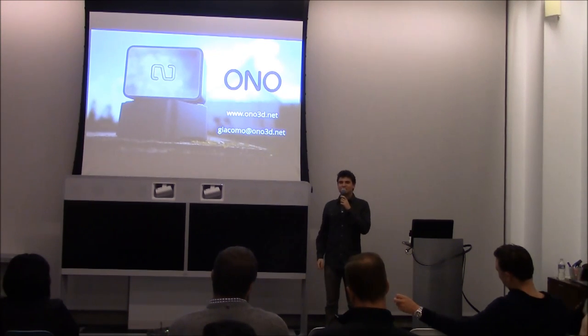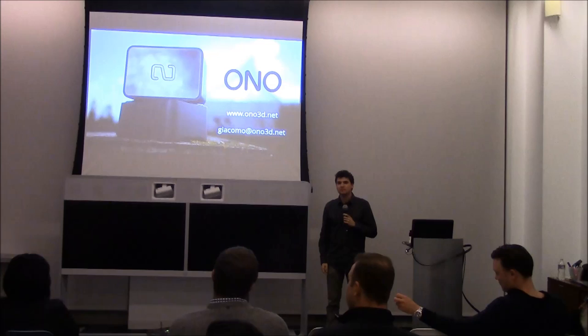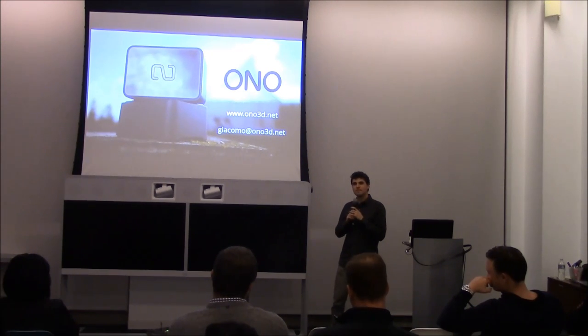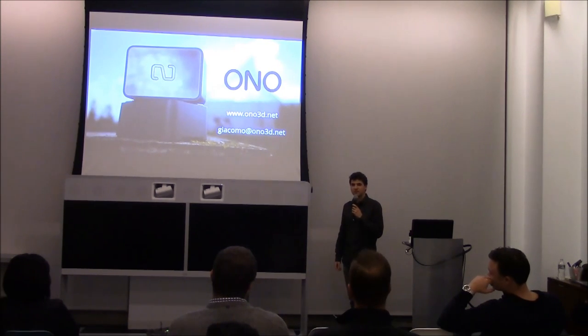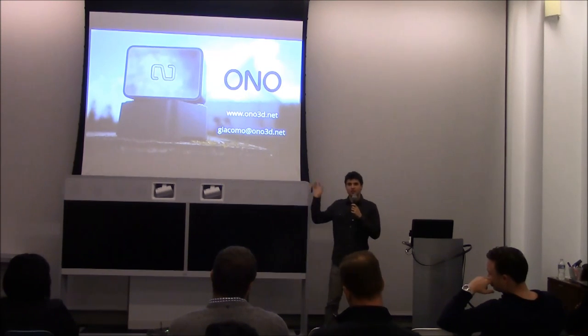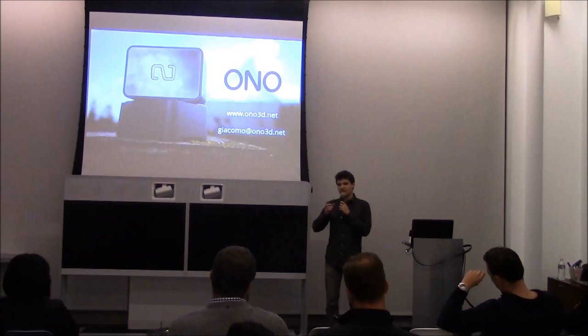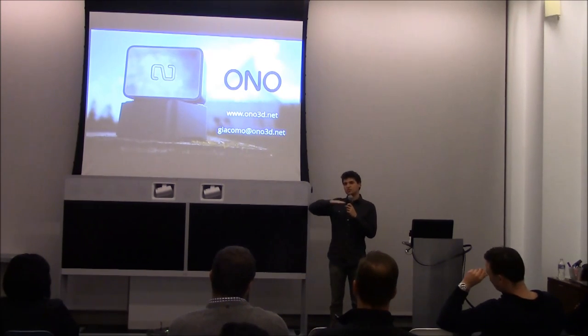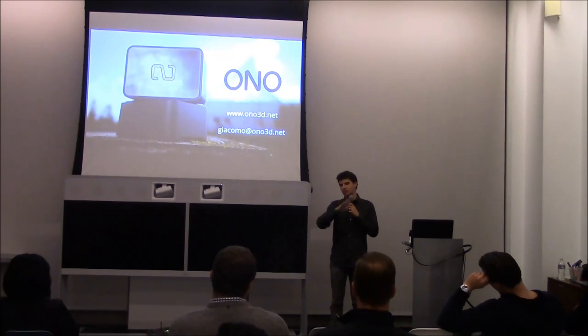What kind of volume can you make — like how long does it take to make a ring or a piece? The good thing about these types of printers is that the only thing that changes the print time is how high you have the object. Each layer still has the same amount of light showing, so whether you do a finger ring or the full build size, it takes the same amount of time if it's the same height.